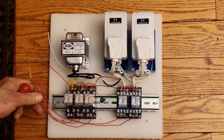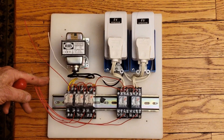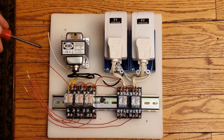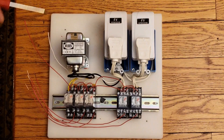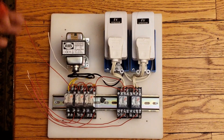All five relays on that contact side are jumpered together. When any one closes, those wires get wire-nutted along with the return side of the control signal going to the boiler — so any energized relay can turn on the boiler pump. I've tried to make the explanation as clear as possible; once you see it all wired into the system it should be clearer. Let's wire it in and see if it works.